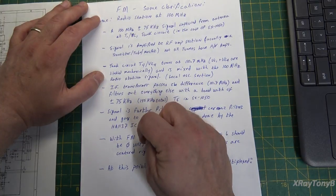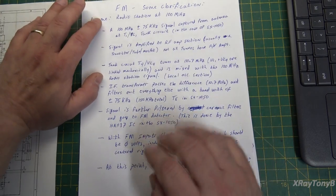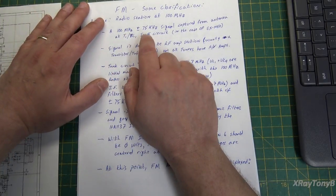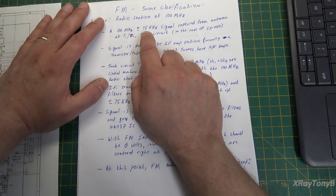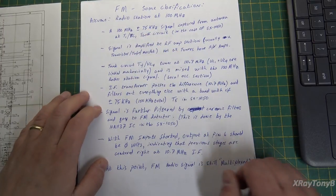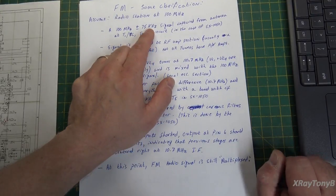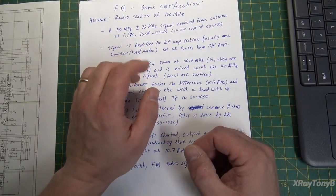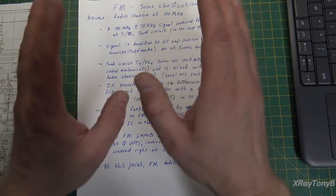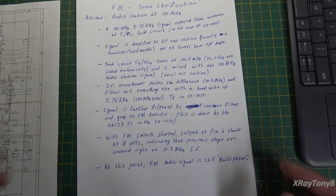In practice it would be 100.2 because stations go every 200 kilohertz. But let's say it is 100 megahertz — that's the center frequency — and the actual modulation will be plus or minus 75 kilohertz. That's 150 kilohertz of bandwidth from one end to the other, centered at 100 megahertz. Our stations are 200 kilohertz apart, so we're using 150 kilohertz and still giving ourselves 25 kilohertz on either side for clarity.